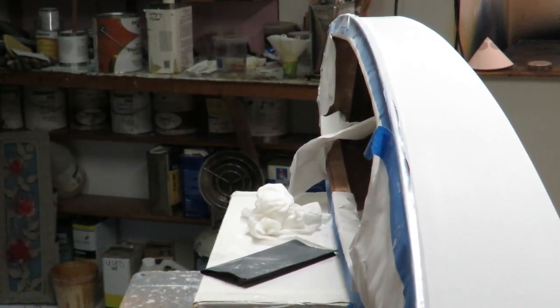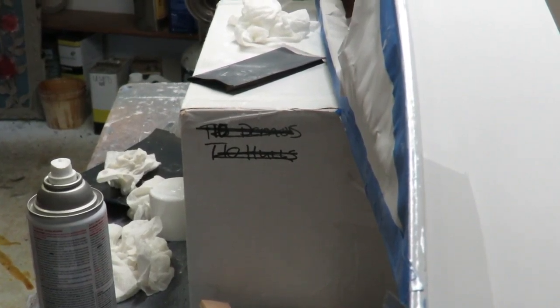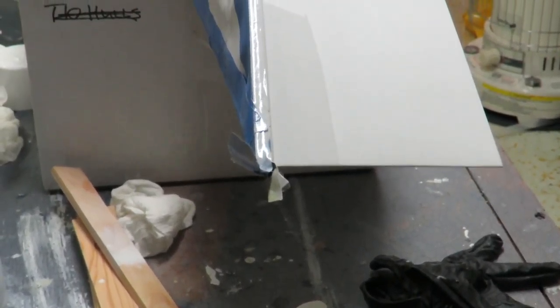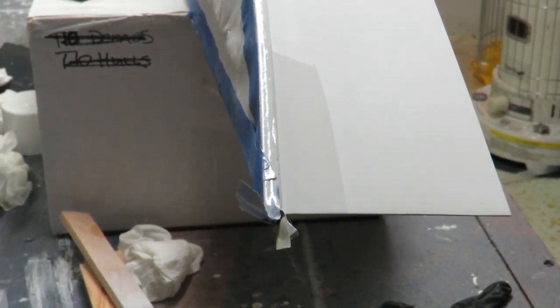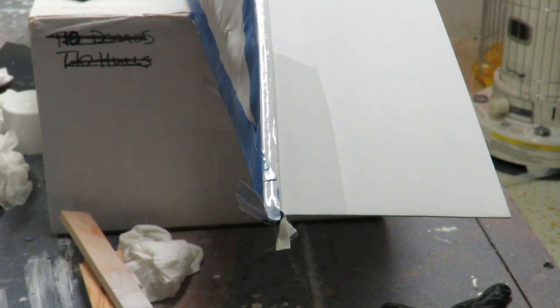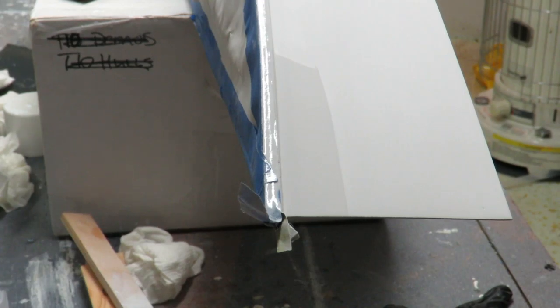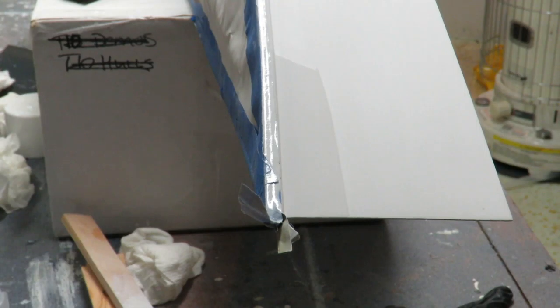Okay, good job. Well, tomorrow we'll sand out that last bit, and then we'll start with 800 grit, and then we'll move on to 1,000, 1,200, 1,500, 2,000. Those go pretty quickly. The trick with each grit is don't skip any area. For instance, with the 600, if you skipped one little area that had some stippling, it would be a lot harder to sand out with 800.